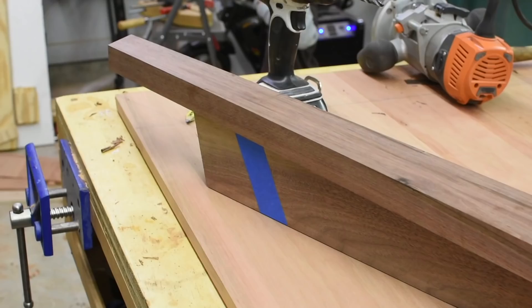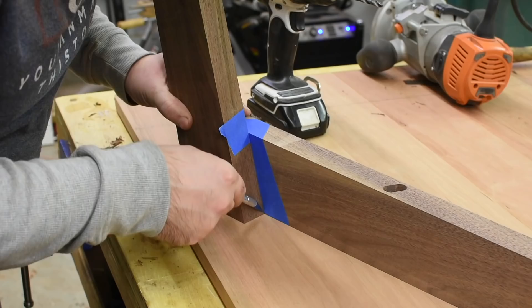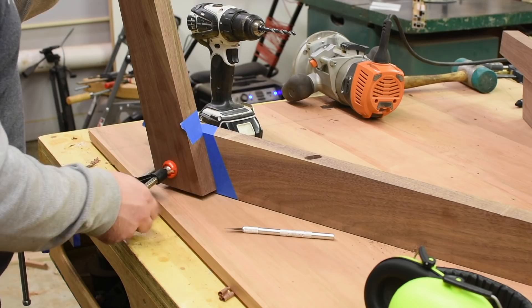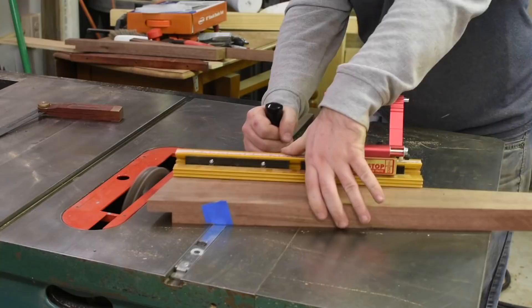With the stretchers and legs at their final shape, I can move on to cutting the half-lap joint. I mark each joint individually just in case there's any differences between the pieces and make sure I get the best fit. My exacto knife leaves a much thinner line than a pencil, so I tape each piece, clamp them together, and score the tape where the cut needs to be. I like this technique because it gives me a precise but really obvious boundary. And again, I pull out my bevel gauge so I can transfer the angle from the tape to the miter gauge on the table saw.